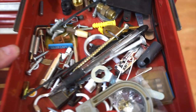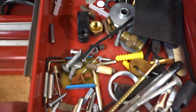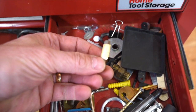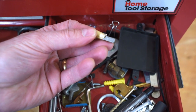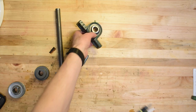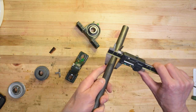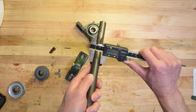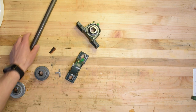My wife had bought me this tool chest a few years ago and I haven't really inventoried everything in here. I just noticed this — a little piece of 3/16ths keystock. I can use this; it's a perfect length, I might cut it in half. So here's the problem: here's the shaft, the axle I'm going to use. My OD is three-quarters of an inch — it's not perfectly round but it's pretty close to three-quarters of an inch OD.